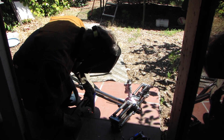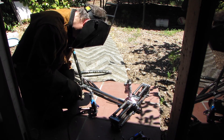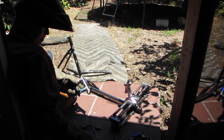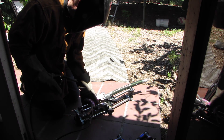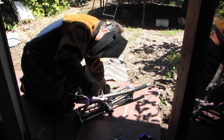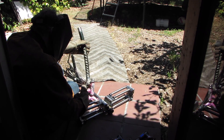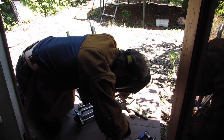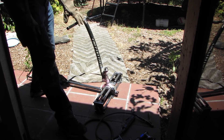The first things I'm putting together here is just finishing a bunch of welds on the steering components left and right. This is of course where I wish I had the TIG welder. Welding this tubing with the MIG welder is just awful because the tubing is such a thin wall — you can burn right through it. So I just did little tiny welds: weld, stop, weld, stop. That was enough to get it solidly together and weld it through the frame. It's really ugly but it's together.